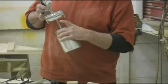Now, one of the other things I did, if you remember when I was building this, I was using a washer-headed screw. When I put it back together, I'm just using a regular flathead screw, so it kind of countersinks. The reason for that is these shelves are now glued in here. When I'm done, I'm going to take the screws out and replace them. This is a 1 5/8 rose head nail. So that black nail is what you're going to be seeing from the outside.